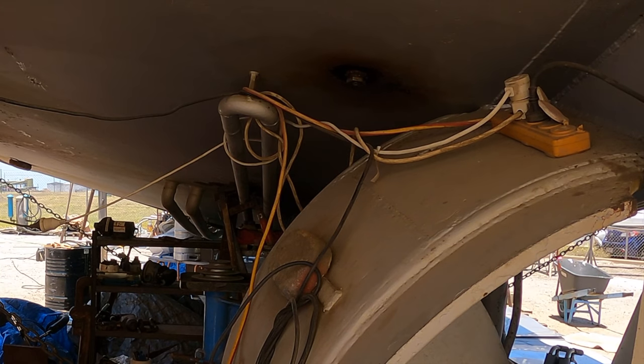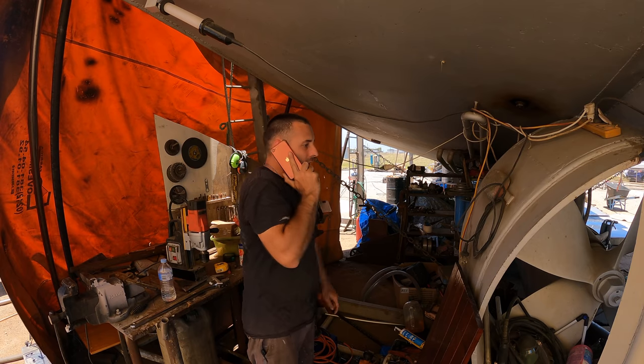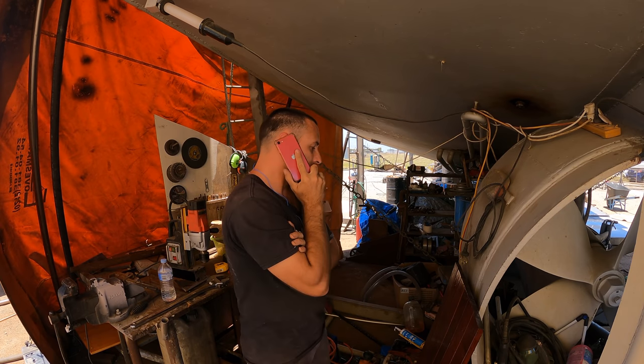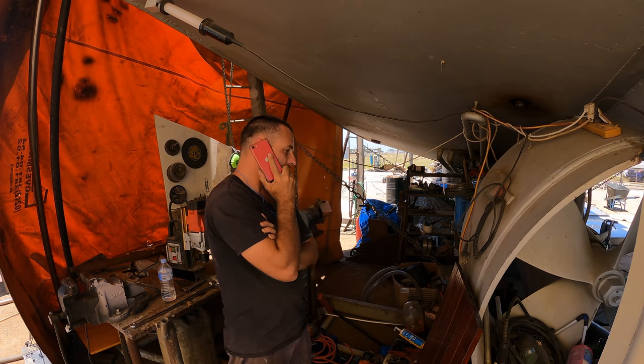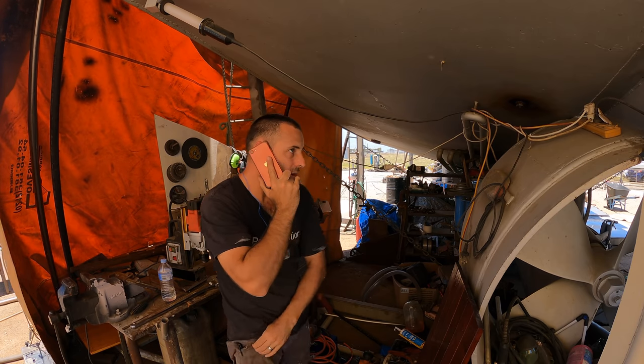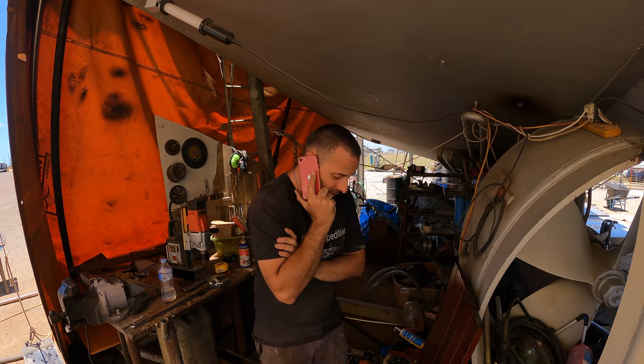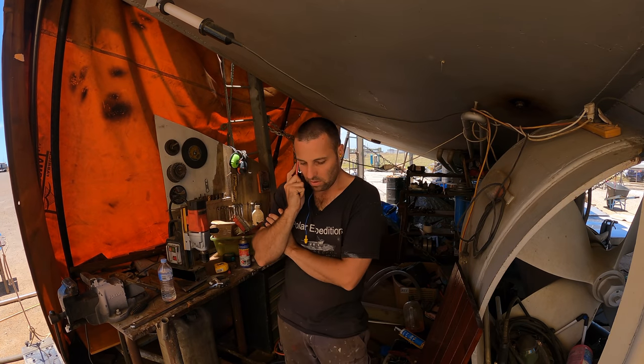Right now, the keel cooling pipes are on the boat, and they will be cut off before we go to Antarctica because they're too exposed. So when we redesign the system, we're going to basically build internal cooling. We'll build a sea chest that is cooled sort of inside the boat, so ice can't rip it off. There's going to be a fair bit of experimenting with this. Like, we don't know what is the optimal setup for it.